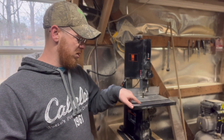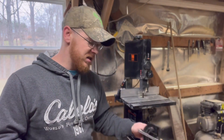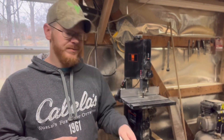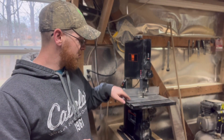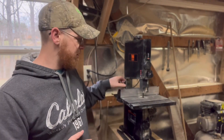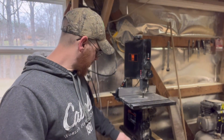It does come with a fence, which is decent. I like measuring all the way to the end and finding the measurement at this little T-slot right here — that's made for your push block or gauge as it comes through. I measure to there to set my fence, because it's not on any kind of track and you can get out of square pretty fast.